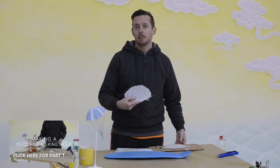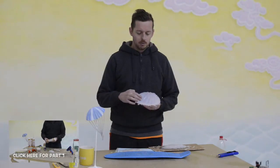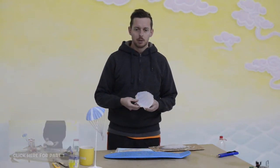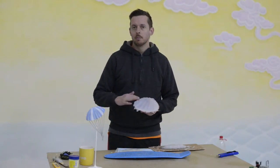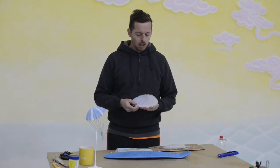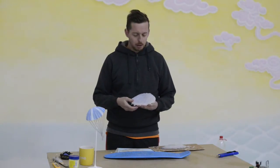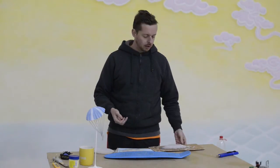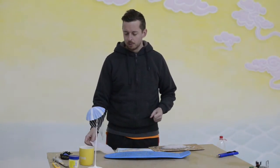Okay, so straight applying silicone caulking does work. You'll get some of the air bubbles occasionally, which, you know, any flashing that you would have in a typical resin casting, you could sand off and buff out. So that's not a big deal for me personally. But if you're wanting a lot of surface detail, doing some live casting, definitely use the commercial silicone products for casting.